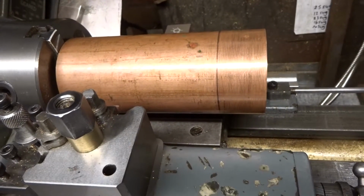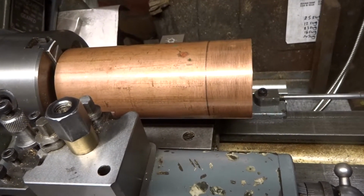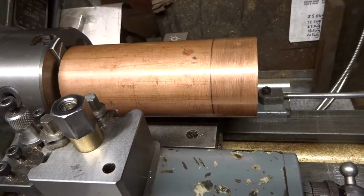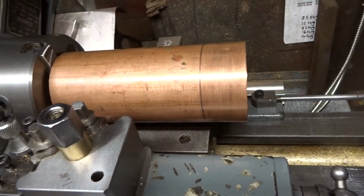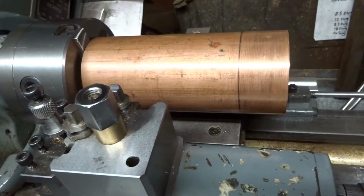This is a piece of seamless copper tube from which I intend to make the boiler for the steam tram, the freelance steam tram. If you're going to make a boiler, I always find the best thing to do to start with is to scribe four lines along the length of the work, marking out the 90 degree points